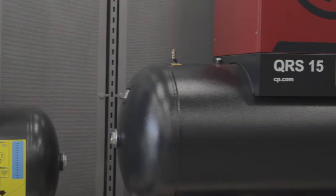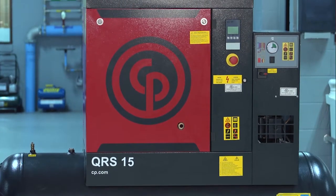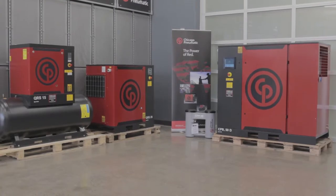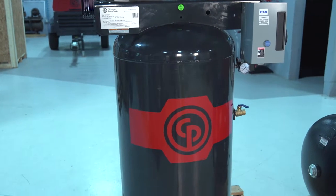On average, for craft breweries starting up with one brew house, a keg washer, and a canning line, we're looking at about a 15 horsepower compressor. They're running about 25 to 30 CFM of air. We size them up a little bit higher — a 15 horsepower gives us about 50 CFM. If we're going to take that next step and expand, we'd need to bring in another system to support it, but for right now it's perfectly sized for what we need.